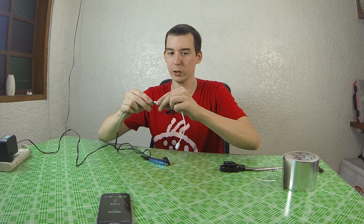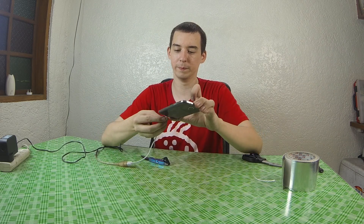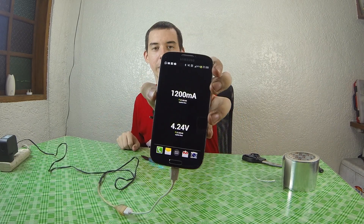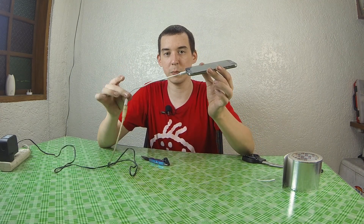Let's reconnect it to the charger and plug it into the phone. You'll see it now says that it's charging from AC. Let's check how much current it's pulling — 1200mA. So just with a piece of aluminum foil tape, we've hugely increased our charging capacity and it's going to charge much quicker.